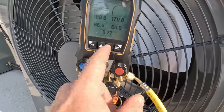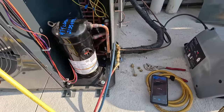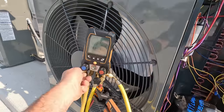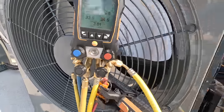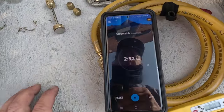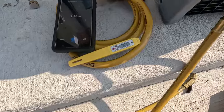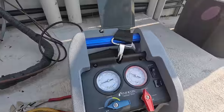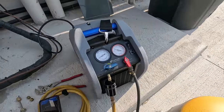I don't know if this thing got twisted off because of possibly not being started correctly or what. There goes the liquid - some suction to it. So far three pounds of refrigerant - like I said this was an empty tank - right at about two and a half minutes. 30 seconds of that is just sitting there talking. 76 degrees out here, we're pulling it pretty quick. We only got one Schrader core pulled, and we do have 275 pounds of discharge on it so it's fighting against some pressure.